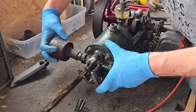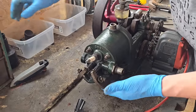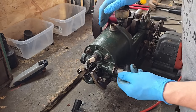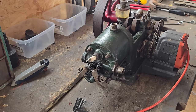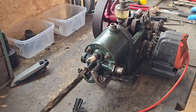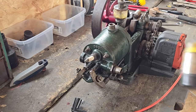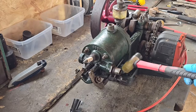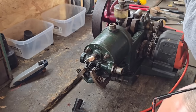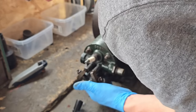Alright, my exhaust — oh, that spins off nicely. Now we should be able to... there's another head bolt on there, is there? No. I'm hoping this head will now tap off. I'm not going to make you guys cringe by using the claw hammer — we'll get a dead blow, my little baby. For a start guys, we'll ask it nicely with a little one. And if nicely don't work... there ain't no head bolt in there, is there? I think this is part of the head. All the head bolts are out.